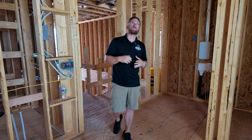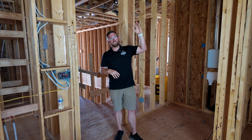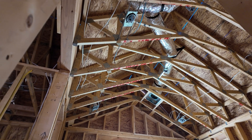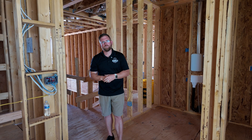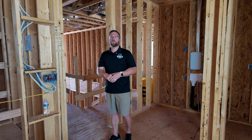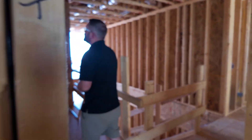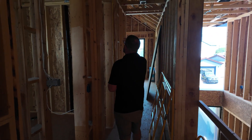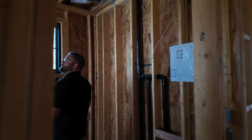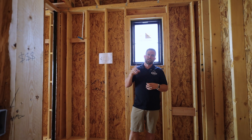For those wondering what a king post truss is: in this case we have a vaulted scissor truss, and this is not a parallel cord — we have a lower pitch on the bottom cord than we do on the top cord where our roof decking resides. We have a king post that runs down the center of the vault to create structural integrity for our roofing and deck system above. As we move out, this king post truss runs the whole length of the house, and by going with a flat ceiling application it really helps increase the space in which we're able to get a majority of our systems within our ceiling cavity.